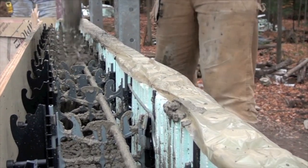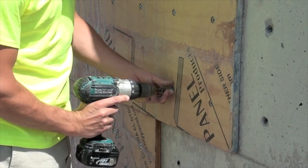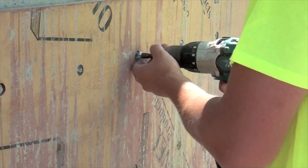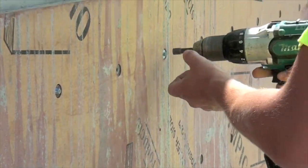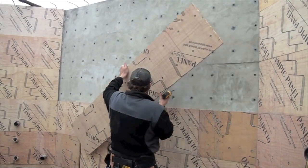The unique design allows concrete to meet with the outside surface of Nudura's standard ICF form. Once the concrete is cured, the form ply panels can be removed, cleaned and reused for the next project, eliminating waste and further costs.